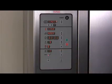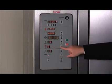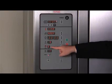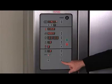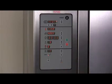Press the up arrow next to the airflow delay to enter the desired time. If no airflow delay is required, leave the number set to 0. Press the vent button to vent the oven cavity for the entire time of the step. The vent button is located in the lower right hand corner of the control panel. When the step is complete, the vent will close.